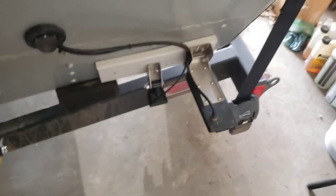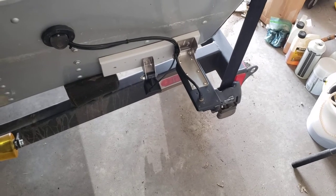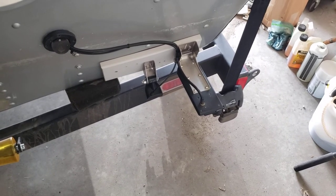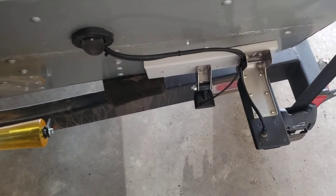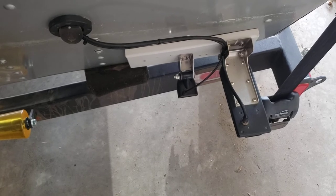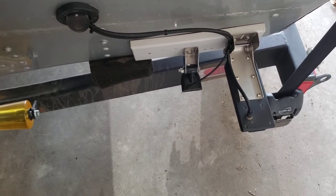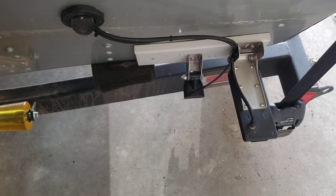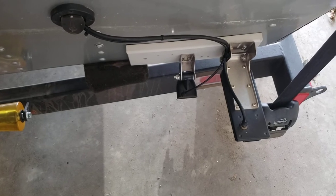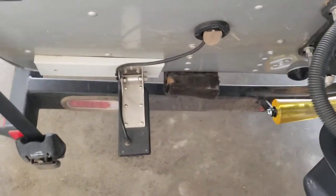The reason they're installed like that is so that if I hit anything floating in the water and I knock off a transducer because it's hanging below the bottom of the boat, I want to knock off that cheap one — I don't want to knock off that expensive one. So, the imaging transducers are above the bottom of the boat and the 2D skimmer sits below the bottom of the boat so that it's in the water when the boat is up on plane. And those imaging ones get pulled up out of the water. So, I've got one imaging one over there and another one over here.